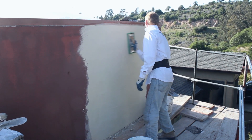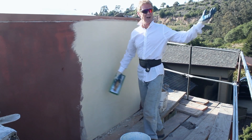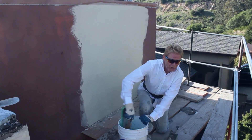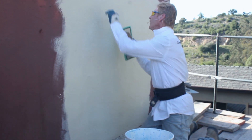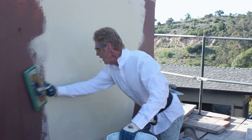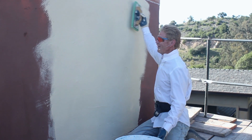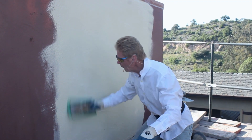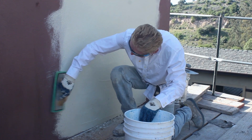They had a decorative beam here and now they want this wall watertight, then they paint the whole thing. If an acrylic finish is not applied over the patch, their coat of paint would ghost. I had a fella send me an email showing me a big house where the paint was all different colors and bleeding. I looked at it and said the fasteners didn't have enough cement over them, and the bleeding is because they didn't apply the primer. He asked how I knew — I said I'm looking at the picture, I know what I'm looking at.